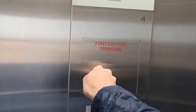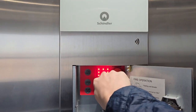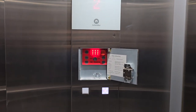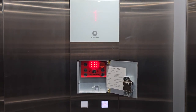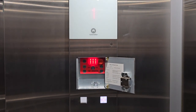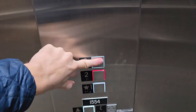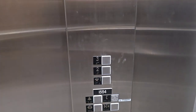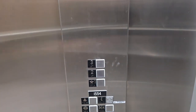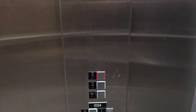You can come back, open your panel, and if you want to send this back down to the recall floor for another firefighter, turn it to off — this will sound the alarm. The elevator is not going anywhere until the fire service key is turned on. Also, if there were any restricted floors, those would be bypassed — whether by a key card or a physically key-restricted floor. So let's pretend floor three is restricted; in fire service, you can go to floor three.